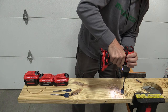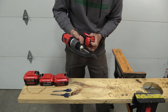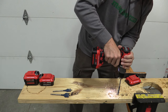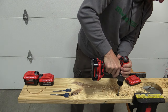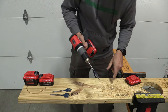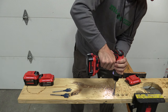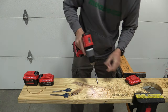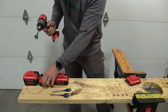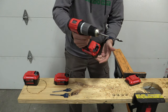With the one-inch spade bit, you can hear it slowing and we're not getting through the bottom of the hole on the two amp hour battery. Interestingly enough, that could just be the two amp hour battery, so let's try the four. Now we caught at the bottom — and that is one reason I like auxiliary handles on this — but there's a huge difference in what you can hear. We're still getting caught at the bottom, but it went all the way through. That's a big difference between a two and a four amp hour battery, and why I don't always judge performance on a smaller battery.